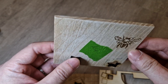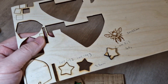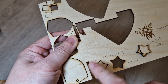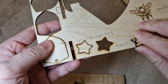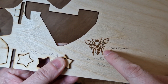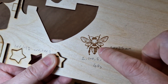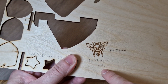Overall I think this is pretty good. The next wood is balsa, which you commonly find for crafts. This particular piece is 3.3 millimeters thick. My first try with two passes didn't give me a clean cut, so I did another one with three passes which gave me a clean cut. The engraving is quite even and all the details and bulky parts came out really well. The whole thing took 40 seconds.